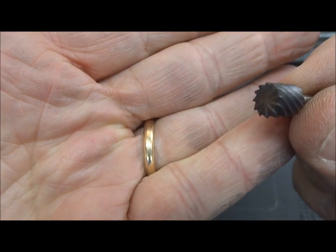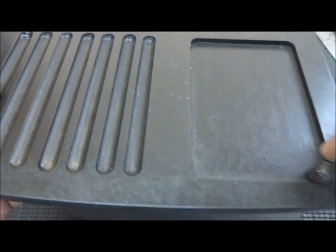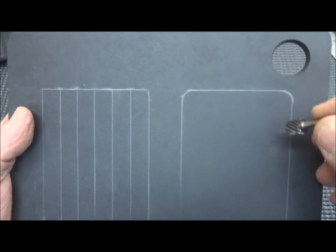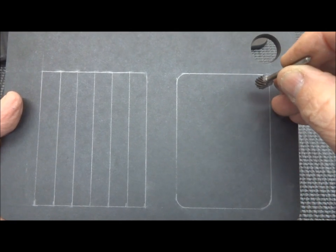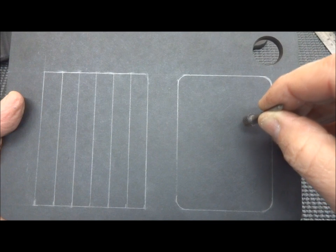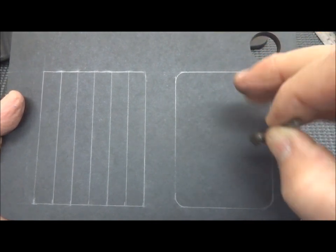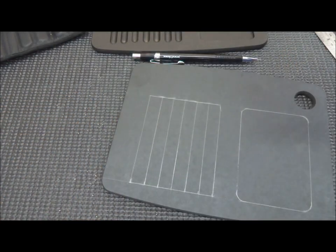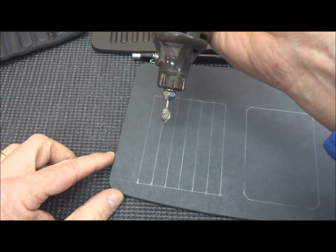We're going to use a high-speed carbide bit in our Dremel tool and simply decide how deep we want it and go around the edge. I've rounded the corners just a little bit — I don't want pins getting trapped in the corner, so rounding it off makes it easy to chase stuff out. I've learned a trick: when you cut around the edge, don't go the full depth on the first plunge. Start in the middle, work your way out, set the depth around the edges, then carefully thin out the middle so it's equal depth across the entire pocket. Eye protection, hearing protection, all that stuff — and I'm going to start cutting the grooves first.